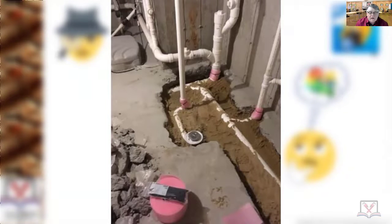Some good stuff here — the plumber sleeved the piping, which is really awesome. It's a good attempt at sleeving. But just using one wrap of what we call sill seal — that's really meant to go under the plate on top of a foundation wall — not really the right material here.